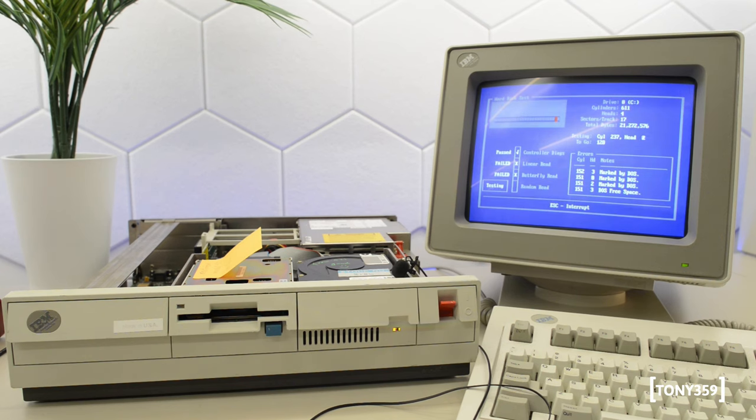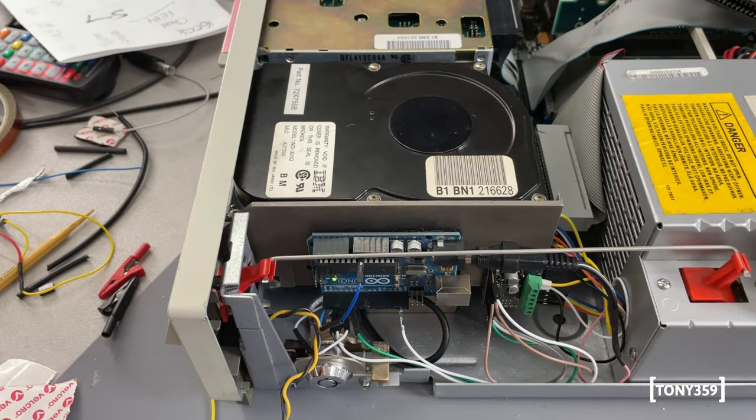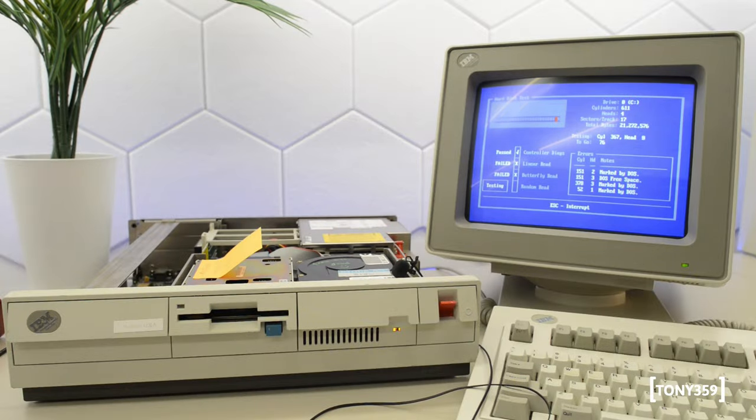When comparing the sound from Epictronics' video, it seems that the real hard drive moves the heads faster than my contraption here. I did try with different speeds, but I was unable to match the same pitch. I think I might be able to step the motor faster by using my own code, that is, by making loops sending pulses rather than using the AccelStepper library. However, in the end I decided that it was not worth the extra time invested. Do feel free to recommend though.